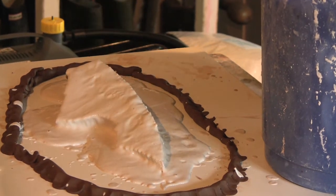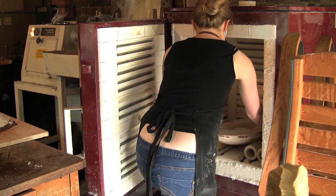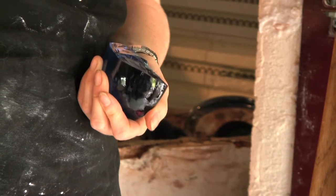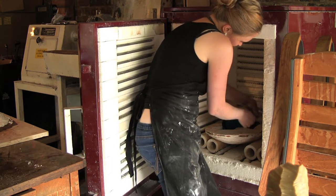The GelFlex is taken out and I pack that mould with a glass and ceramic mix, using different colours and different grades of ceramic for it. It all gets pushed together and put in the kiln. The glass comes out and I break away the mould and get this lovely glass form, and usually I'll work on that a little bit — using a grinding grit, grinding wheels and lathes and diamond cutting machinery to cut through the material and finish it.